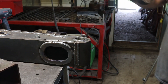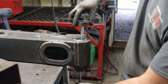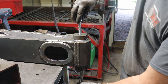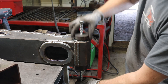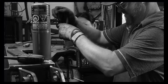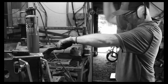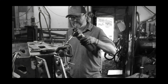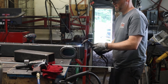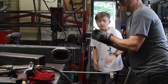It's time, once again, to try the press-fit bushings. As a backup plan, I'll use a half-inch all-thread rod to act as a press. You might remember the last time I tried the frozen bushing / heated housing technique — it didn't go as planned. I took the time to repair my torch, so it should work better this time.